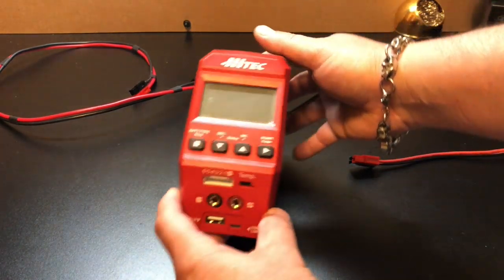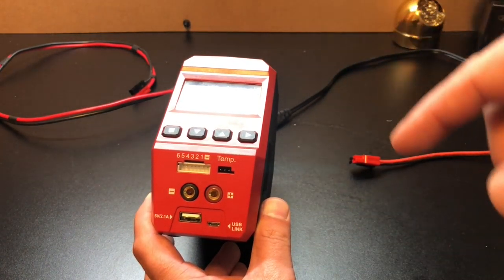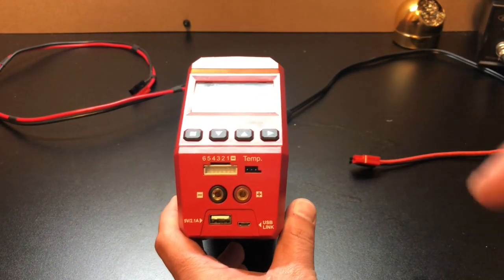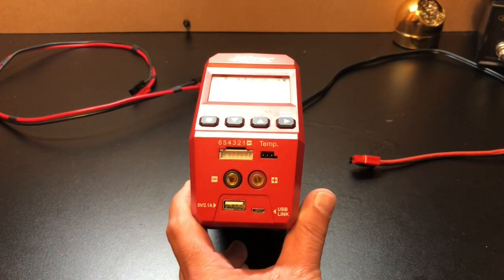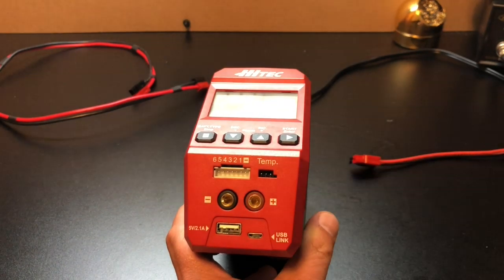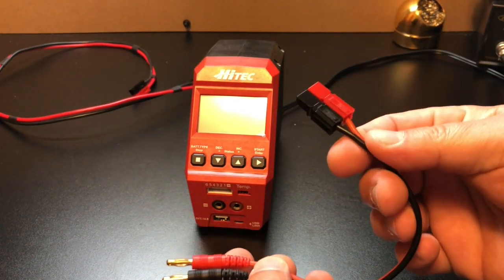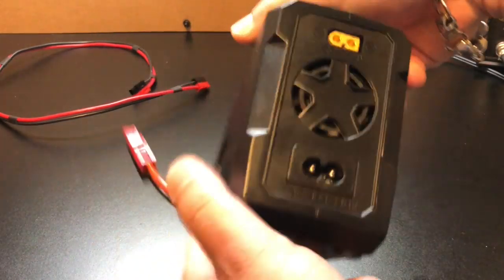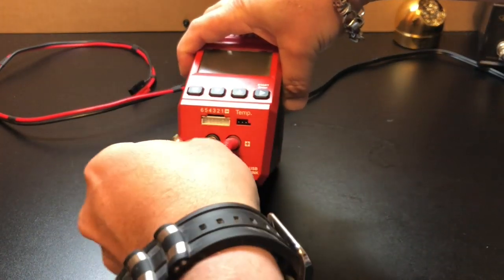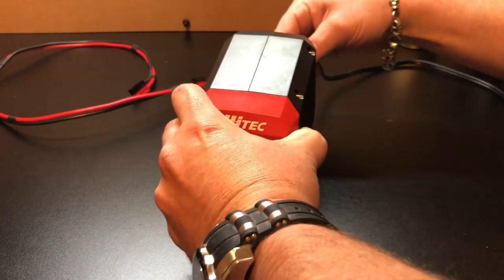Here is just kind of a close-up look of the charger. There's a couple different ports. You can hook this one up if you wanted to specifically wire your battery to have a certain type of plug. This port right here would be kind of how you could get around having a BMS, I suppose — I don't think I'd really do it that way, but you could. On the back is just an AC in. There's also a DC in, and that's about it. So I use these plugs, and it came with little banana plugs that had on the other end — we cut off whatever's not a power pole and put power poles on it. I think it's called a Dean's connector maybe. That's what it came with. So we put power poles on it, and we simply plug that in, and then we plug this into our battery. There's no power switch on this, so you just have to plug it in.